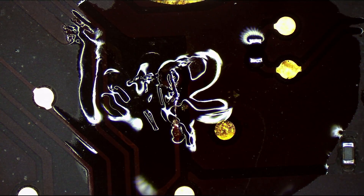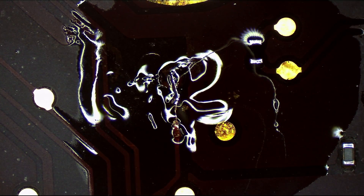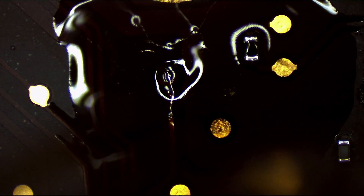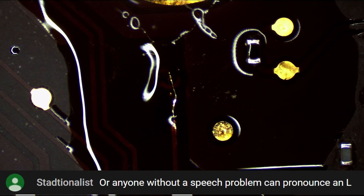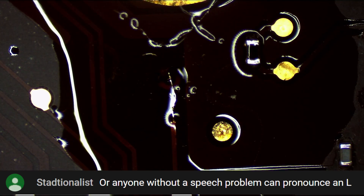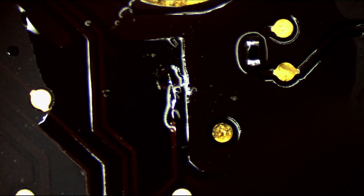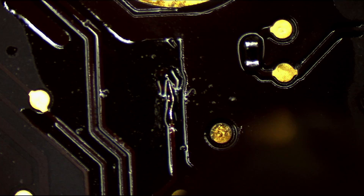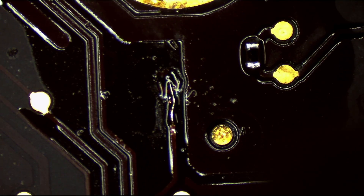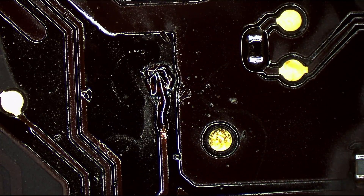Now it's hard to solder something that tiny, so I'm going to use hot air and allow the surface tension to flow that into place. We do this — a little bit of hot air — and we flow that into place very nicely. Yes! Yes! All right!